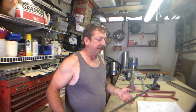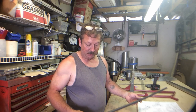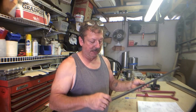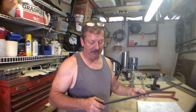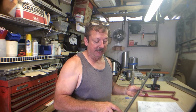I've already drilled this tube — it's exceptionally long, just a piece I had. Once it's notched out and set on the side with the insert in, I've already drilled the holes. I set them up in the drill press and leveled the table with the bandsaw table for support since it's a long piece. The holes are 3/16 inch, 10 millimeters back from the front — standard spacing. Then it'll be slotted top and bottom to clear the bell crank so it has room to pivot. They call for a 4 millimeter hole, which is approximately 3/16 inch.